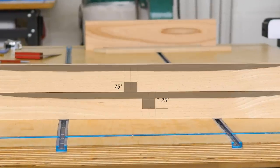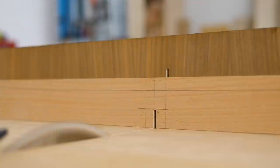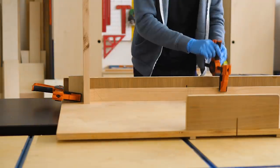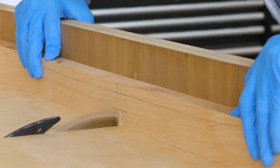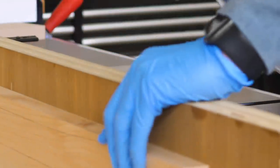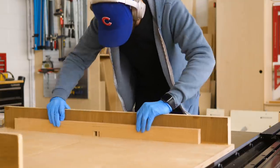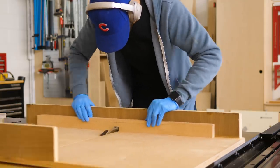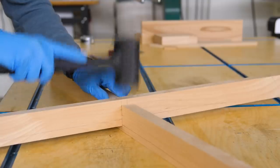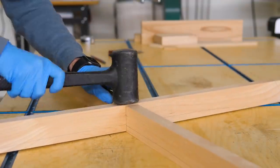To make the actual cuts, I'm just going to slowly raise my blade to get the cut right where I want it, and then use the eighth-inch drill bit trick to make the dado perfectly sized. Once everything looked good, I repeated this process on the other stretcher and then I could test fit them. The joint is definitely on the tight side, but I like that because it means after I do all of my sanding, they should go together easily enough but still be pretty tight.